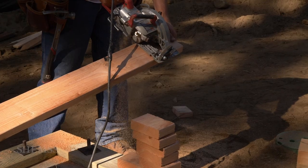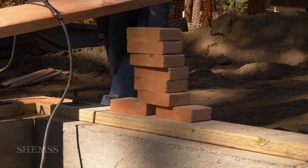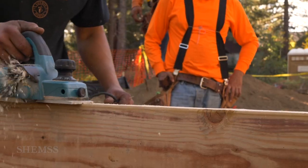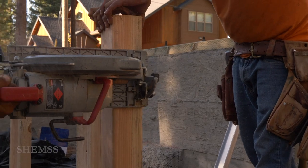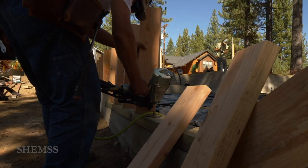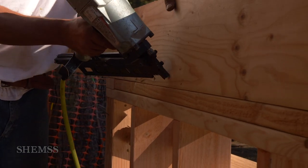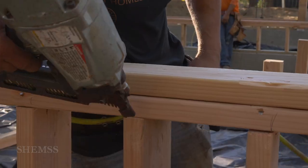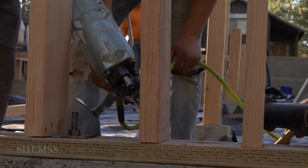So what is a pony wall? It's a short wall built for the purpose of bringing up the leveled height of the finished floor. The wall is 6 inches wide all around. The pony wall consists of two top plates and a bottom plate with studs in between at regular intervals.